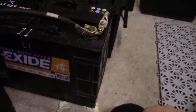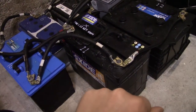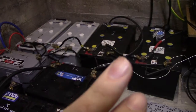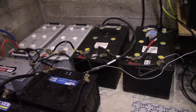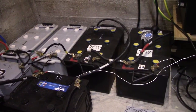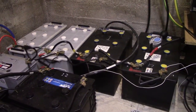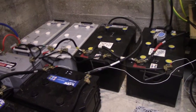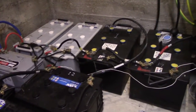The shape of the case just doesn't instil me with confidence, so mostly I want to guard myself from shorted cells—that's why I'm going to be removing this one. The rest are probably staying. I have not come across more than one truck battery of this calibre that has had a shorted cell, and that one had handled it very well—the plastic case had expanded as the truck's heavy-duty alternator had pumped it full of juice, it bulged a bit, but it finally went open circuit without any major damage.